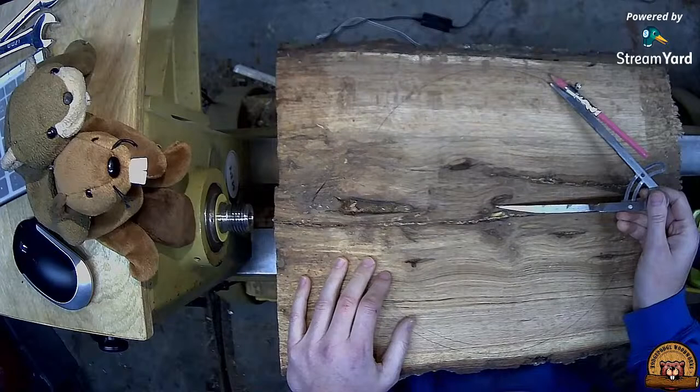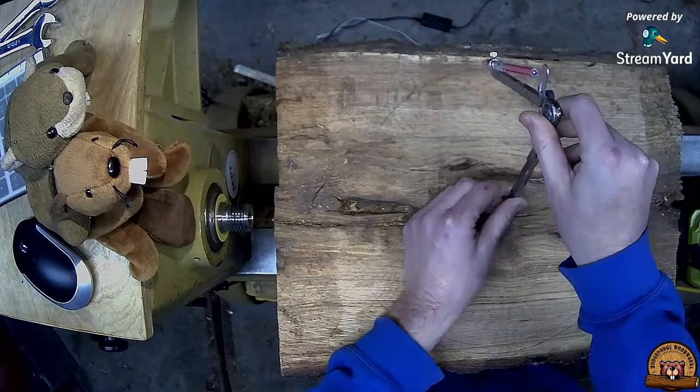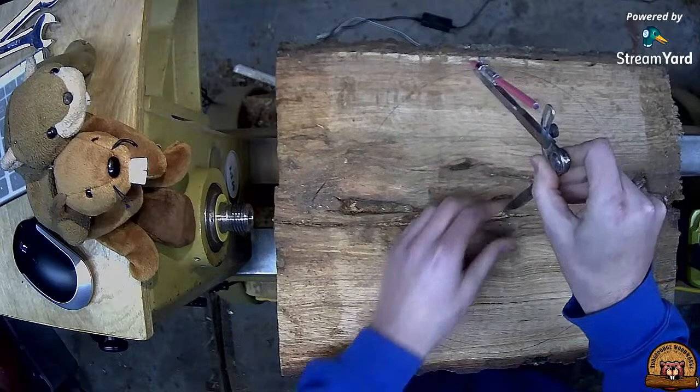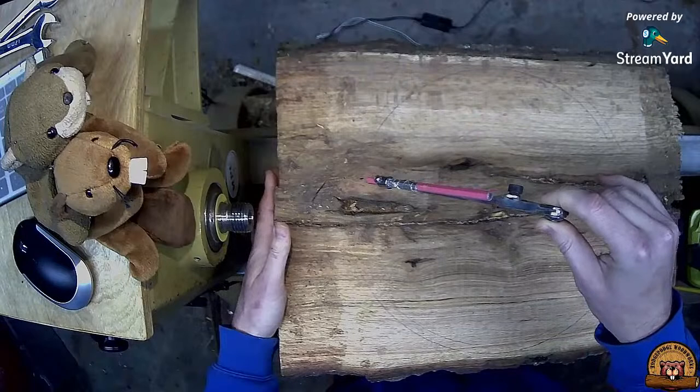So first off, all I do is take this compass here, kind of guesstimate the center. I don't have to mark or measure anything. And then I kind of guess where the center is based on the gap on either end of the wood, 180 degrees apart. And then I'll adjust as necessary and find the maximum diameter I can get. And then from left to right, I always cut my logs a little longer to hopefully reduce any cracking I have on the ends once I cut it.